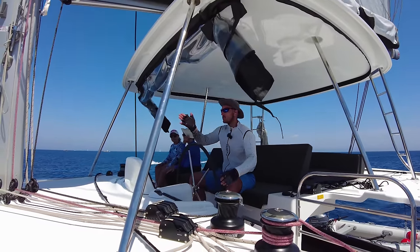Now this is a very delicate point, and how much you learn comes by experience. It should be straight and a little bit more, but overdoing it might cause problems. Holger is looking up, and that's why he doesn't realize that the rope is slipping, because he doesn't have enough turns on the winch. Let's press again so you see what happens. You see it's slipping, so we put another turn, and now we're going to have enough friction. Now it's turning nicely, and the sail is tensioning. Maybe one more. Okay, that's it.